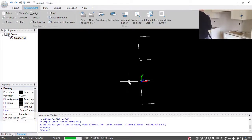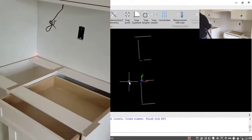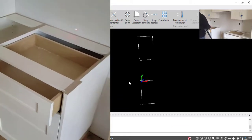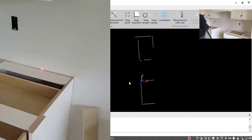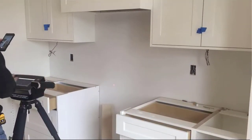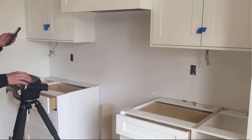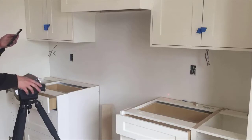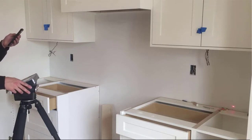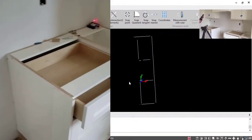Now I want to scribe this back wall, so I'll select the line command on the unit and start at the left side. Just visually looking at this wall, it's pretty good, so I'm going to take points every six or eight inches roughly — that should give us more than enough data to scribe from. Working my way along, just aiming the unit by hand, I can go right through the stove opening in case they end up adding a stove bar bridge afterwards, and I've got the scribe data should I want to scribe that piece to the wall. Just working my way along the wall, taking another point there and one more right in the corner — not quite in the corner but about a half inch from it.